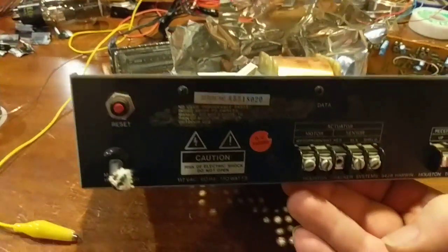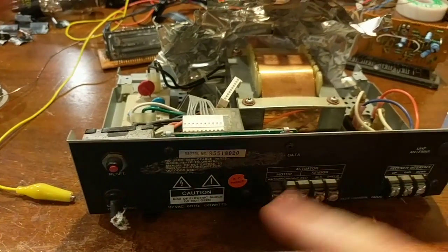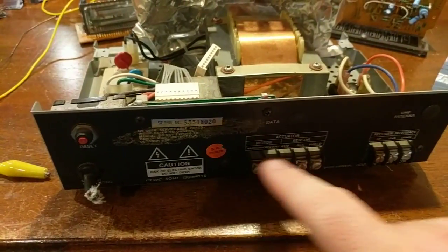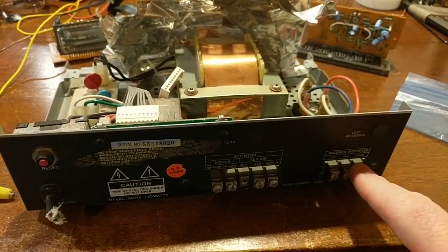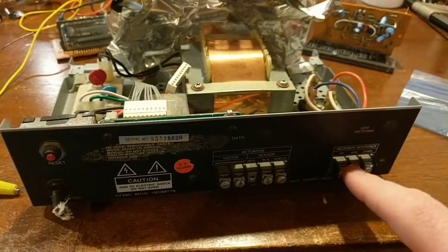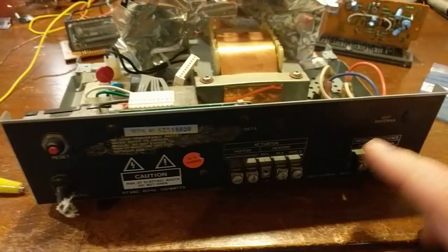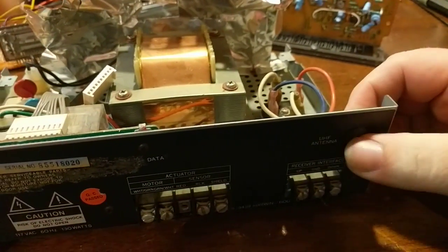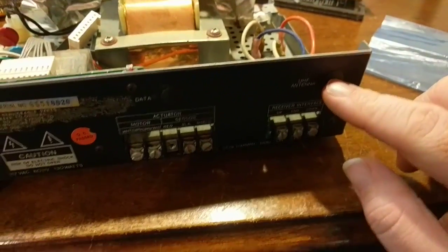And on the back of this thing is nothing too important, but one of these will be the DC in. Some of this stuff will be removed. I'll probably remove this, make this my speaker jack, my left and right audio. This will probably be the RCA level out, or maybe even if it's a big enough hole, I can probably put my RJ45 jack here. And then perfect, I have these holes, these little plugs that pop out right in here for F connectors. I can repurpose those for my Wi-Fi antenna or USB.